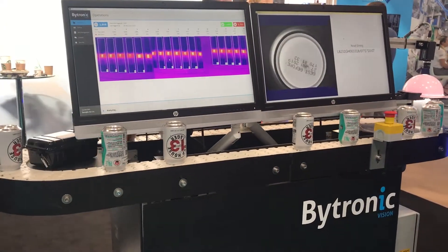I'm Stuart Jackson from Biotronic Automation. We're a machine vision system integration company. We design custom solutions for anything you could possibly want inspecting. We're here today showcasing some new technology — some artificial intelligence systems for reading complicated inkjet-printed or laser-coded text, and also some thermal imaging for inspecting products that are heat-sealed, looking for contaminants in the seal and things like that.